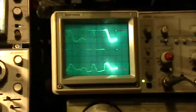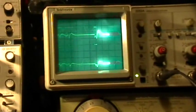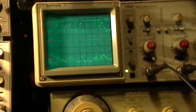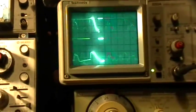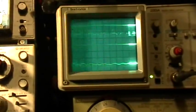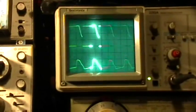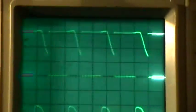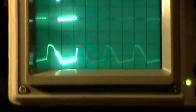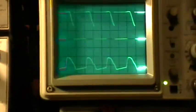Let's try this again. Now we're seeing some action. There's a very narrow point in there — there we go. Now we have that action happening on the top trace, with blocks of really high frequency oscillation, and we have the nice shark-backed hump on the bottom trace.